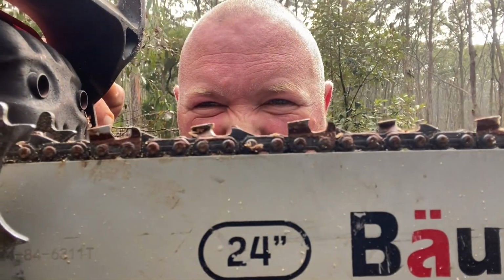I don't know if you will make it out, but it's basically a hardwood setting for softwood setting for 3/8. My filer plate for 3/8 was actually 0.375. Something happens when I flip it, so it takes the rakers down too much on one side. All you're simply doing is flipping it over to put it on the other side, or maybe it's because I file my rakers both in the same direction, but that's a myth as well.